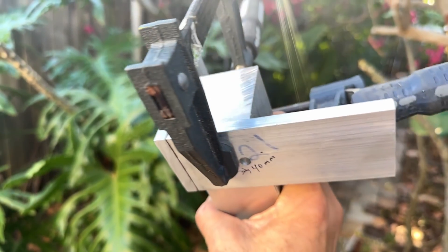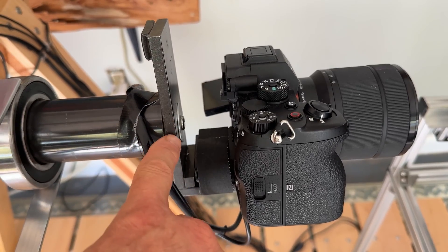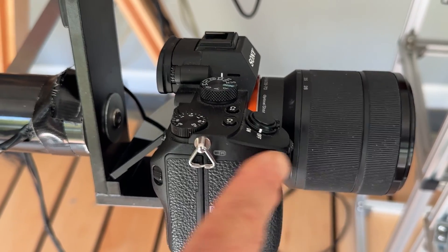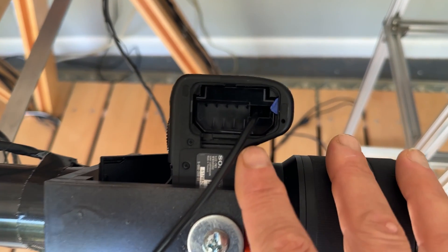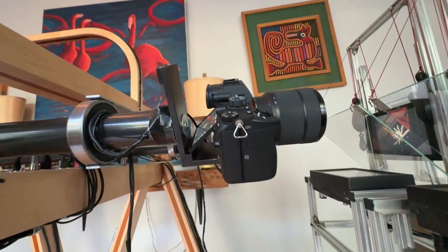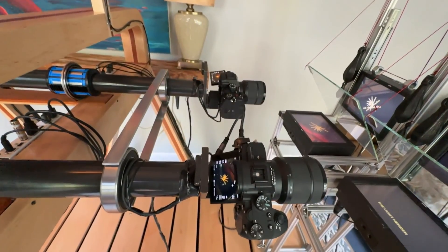To help with the wires going to this rotating monitor, I swapped out the heavy control module cable with enamel wires — ten enamel wires twisted together. The camera mounts have also been updated; instead of being made of wood, they're sleeker, made of aluminum. There's play in the mounting holes so the mount can be slid up and down on the shaft, and the camera can be slid left and right, so the center of the lens can be lined up exactly with the center of the shaft. The cameras are also hardwired for power, so batteries going dead are not an issue. I'm using the A7S III now on the left side with much improved autofocus; the older A7 III is still on the right side, but maybe one day that'll change.